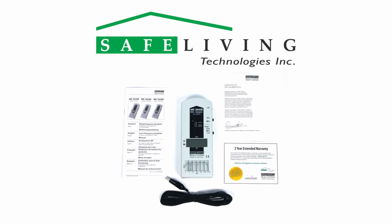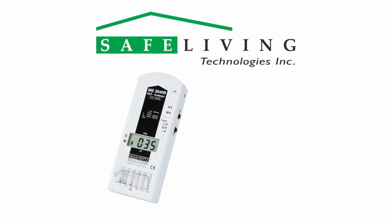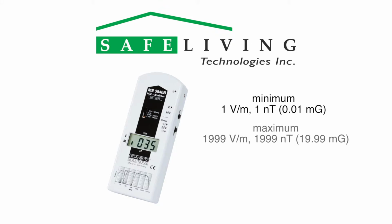Included in the box is the meter with a 9-volt battery installed, the operating manual, grounding cable, warranty, and certificate of factory calibration. The ME3840B offers excellent sensitivity down to 1 volt per meter for AC electric fields, or 1 nanotesla, which is 0.01 milligauss, for AC magnetic fields. The maximum field strength it can measure is 1,999 volts per meter and 1,999 nanotesla, or 19.99 milligauss.